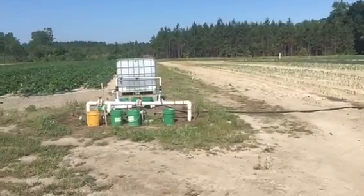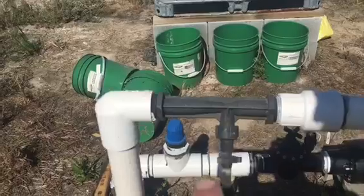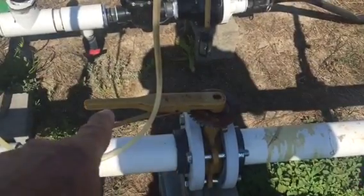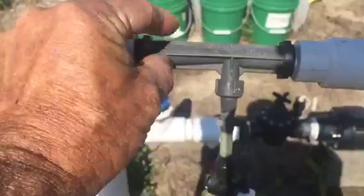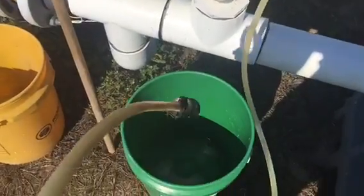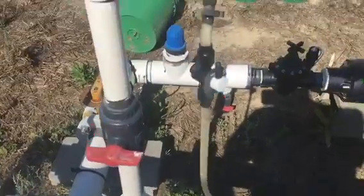Let's take you over here and show you this venturi and how it works. We get fertilizer delivered in this tote — they split it between this end and the other one. We take the main valve on the line here and shut it down about 95 percent, then open the valves on either end. What that does is draw water through — it goes from a larger end into a smaller end and actually forms a suction. We put the liquid fertilizer down in a bucket, put this strainer down in the bucket, and it will suck all the fertilizer up one bucket at a time.